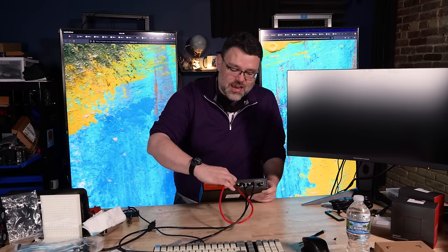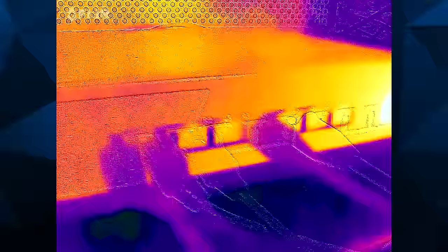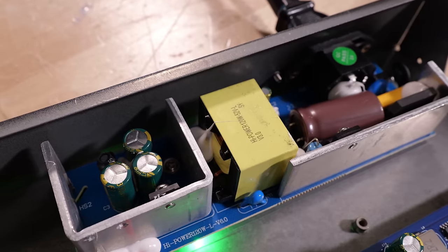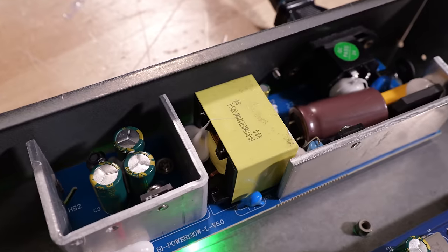This is not managed — not even web managed. Although the chipset does support web management, there's probably a way to hack it on. I was delighted that even though it's fanless, I couldn't get it to overheat. Using a FLIR thermal camera, after fully loaded operation for eight hours it does get concerningly warm. It might have been a mistake to leave out a fan at 90% utilization, but at idle it only uses three watts of power — about one and a half to two watts of that is probably power supply overhead.